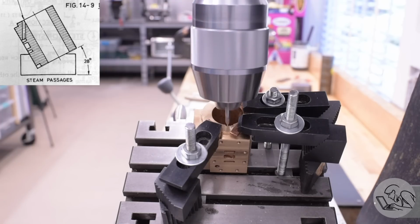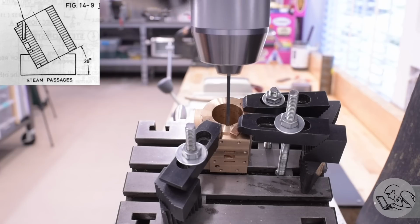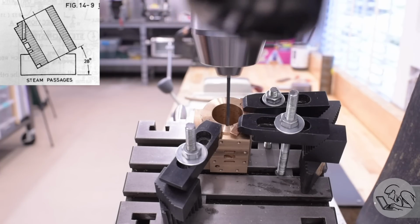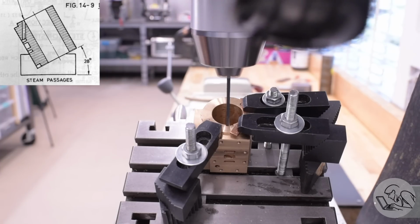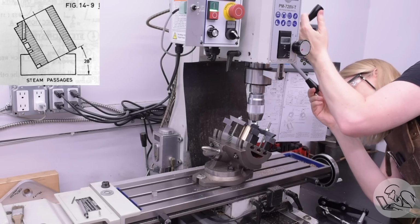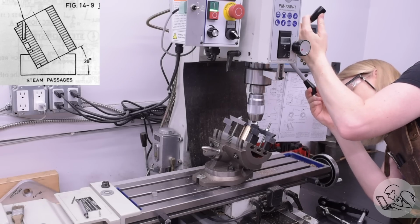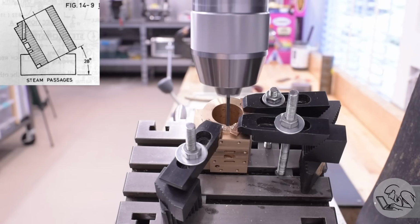So it's like 2 parallel pipes that basically make up enough volume that would be required for all of the steam to get through here. So the volume is the same as the single large hole in the center of the port face. This is a common technique in model engineering because you can't mill a slot all the way down through the middle of the casting like that. It would be an impossible feature to machine. So instead we drill 2 side-by-side holes to get the same physical effect.